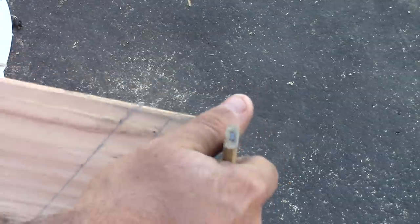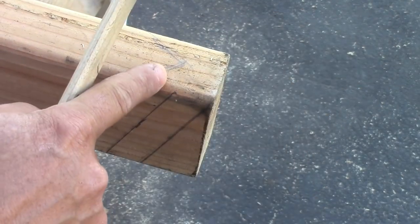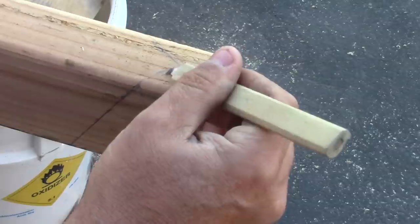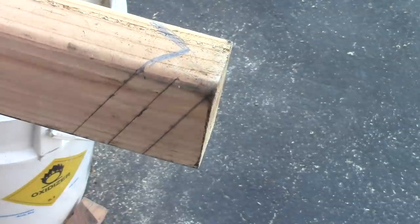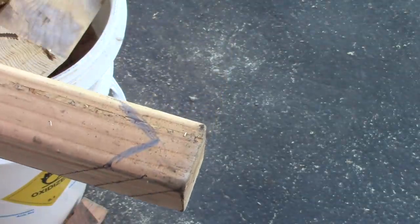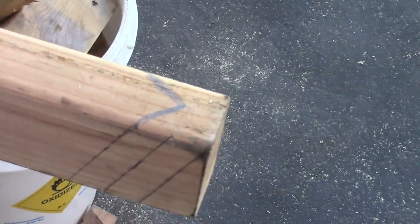The reason you need these three lines is because this rafter is going to come to a point, and the middle line is actually your point. Your point is basically going to look something like that. So now all you have to do is cut it. Your rafter is going to come to a point here — right here and right here will be the point that joins up to your ridge board, so it's going to look something like that. That center line right there is the tip of that point, and we're ready to cut.